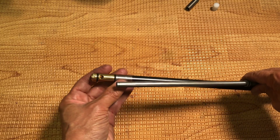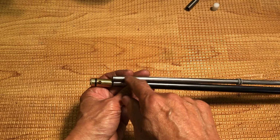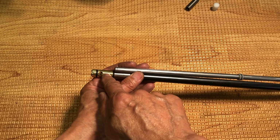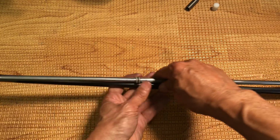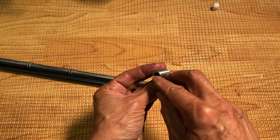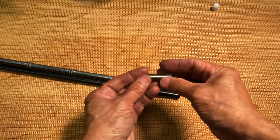All right, you find out when you load the pellet in there, if it's tighter than usual going in. That means the sleeve or liner is not properly aligned with the bore of the transport bushing here. All right, it's very important to have that O-ring there. And the newer ones have the same O-ring in here. There's an O-ring groove in here to keep that sealed, prevent it from blowing out of here or around, filling the chamber up.